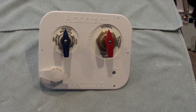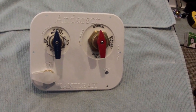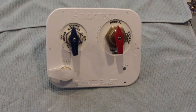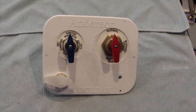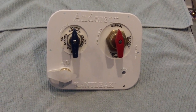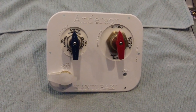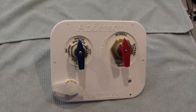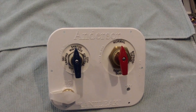And in addition to being able to sanitize the tank, and what that means is that I can draw water from an unpressurized source into the tank to sanitize it. And when we boondock, we have a 90-gallon fabric bladder that we can put in the bed of our truck, take to a water source, fill it up with potable water, and then bring it back to the trailer. And this will allow me to upload that, or to pump that using the pump on the trailer into the tank. And so that was the reason I chose this valve, and I'll leave a little bit better description of the valve and where I purchased it in the description of the video.